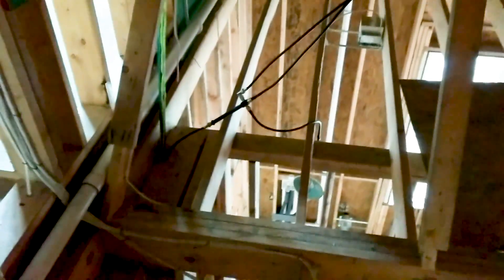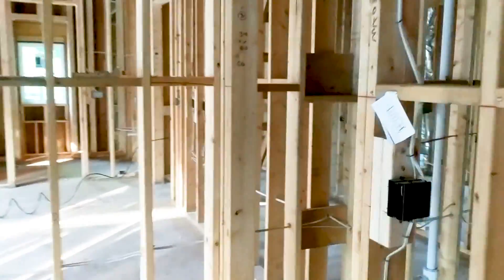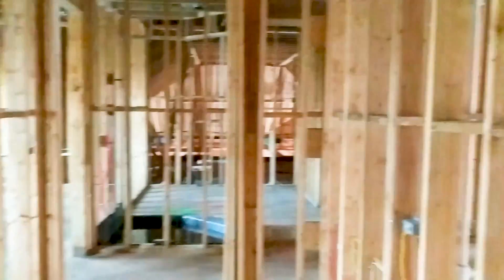This is the top view of the Omnis we just saw — there's my three-way split. I'm running cable along here to the other Omni, and I've got a panel up here flooding the guest rooms and another bedroom. They were really pushing for aesthetics and didn't want antennas on the wall or the roof. The ideal place would have been somewhere in the middle, but they were adamant about keeping the back room — which is going to be an art room — without any antennas, flush and really clean. So I decided to use a directional panel and beam signal through there. This is the third floor, just below the attic, and everything in the house is covered.